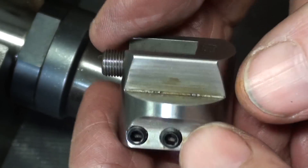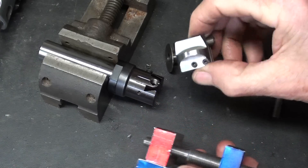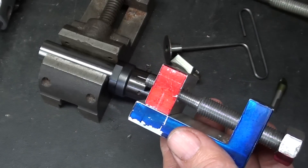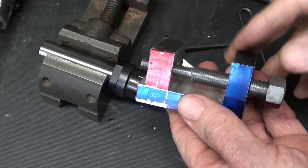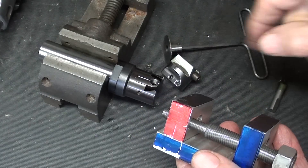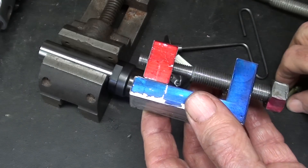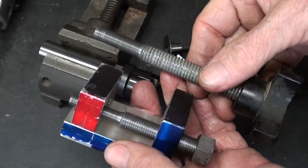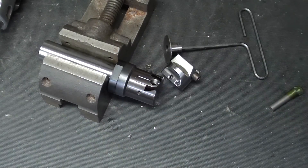These were made in Minnesota, and I believe they made more than one model. For those of you who are intrigued by this little differential screw, that type of screw is used in several devices you might have around your shop — including microscopes, where the slide can be adjusted very finely in two axes with this type of thread. If anybody can think of other applications, put that in the comments. In the follow-up video, which will be number 21 — I've already partially done that — I made a couple of differential screws and I'm going to explain that in detail, maybe even with a little math. So watch for that video if you're interested.